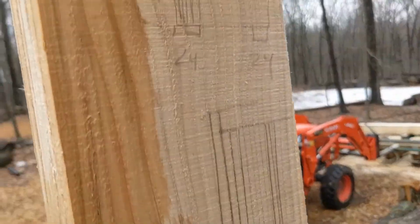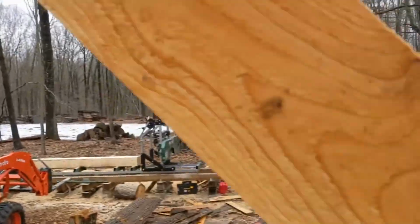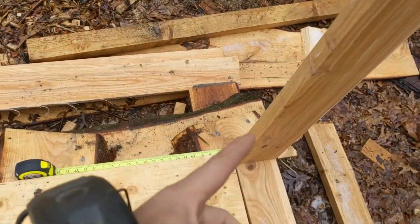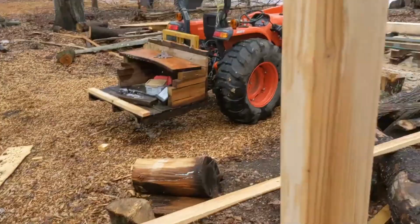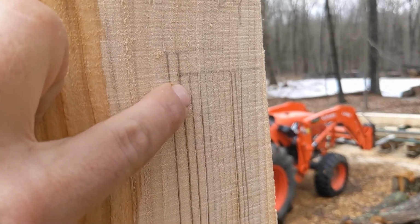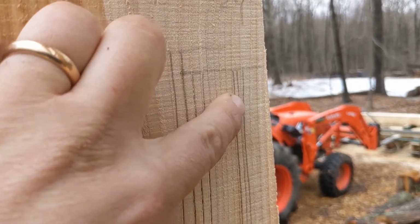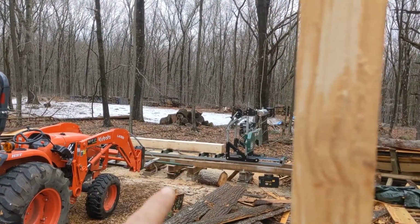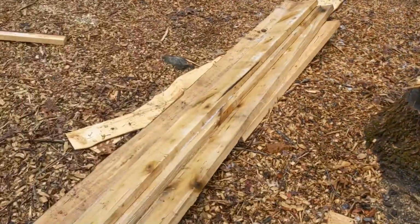But instead of that, I'm just going to set up a regular sort of framing, just like this, for the first 2 feet or so that I have right here. And then I'll have some extra bracing. I know it'll actually be on this side. And that's where I'll have a beam, and I'll cut that beam right from there. So I'll have one solid header.